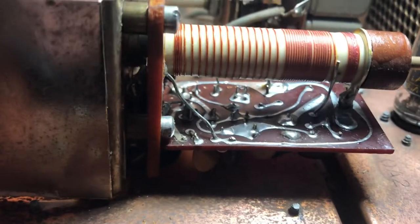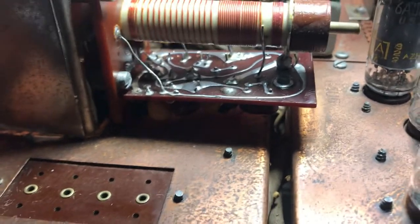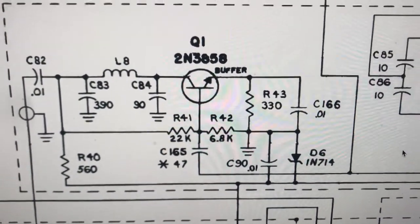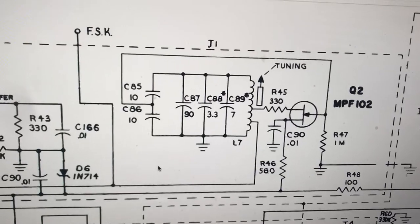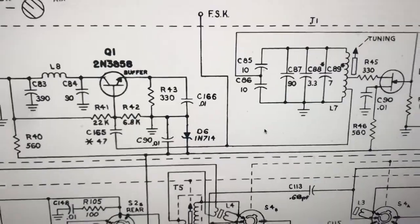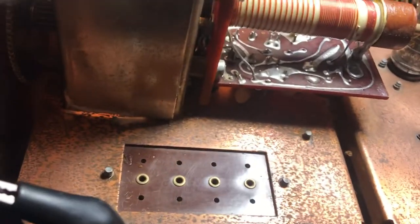This appears to be oscillating fine. Here's the schematic for it, and that NPN buffer transistor seems to be shot — something is whacked. You can see the base of this thing; there's the FET. The base of this transistor looks to be healthy with RF. I can put the scope on the base and there's a lot of RF — let's see if I can show that.